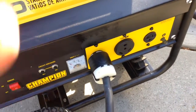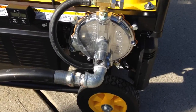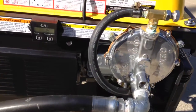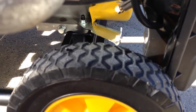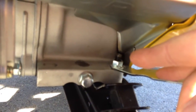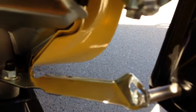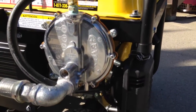I'll show you my natural gas conversion kit. This is from US Carburetion — there are a ton of videos on YouTube on how to hook it up. I already hooked mine up; it's pretty straightforward. The only thing is, if you have a similar generator, there's a bracket in the back with a spacer that braces the air filter. What I had to do is loosen the nut where the engine mount is — the hole is actually slotted in the brace so you have some extra play. I had to make the slot bigger on the air filter side so it could fit properly.